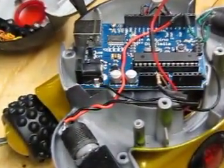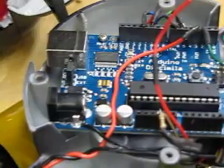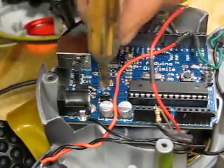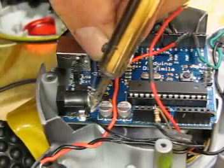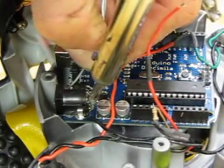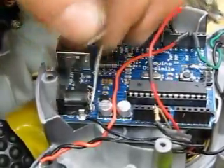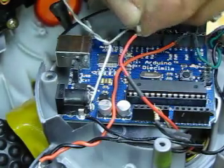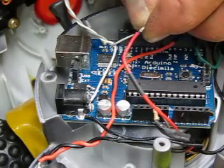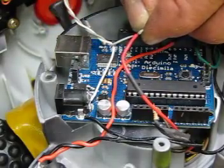I'm ready to solder up my switch wires, and I'm going to solder them right onto this power jack right here. First, I'm going to connect the white wire to the back of the switch. I'm going to get a little more solder down here on the board just to make it a bit easier. It doesn't matter which one goes where — it's just a switch, you can wire it any way you want. I've got a piece of heat shrink waiting there to cover this joint up. Now I have a nice little solder splice for my power: power comes in here, goes to the switch, runs back into the white wire, and feeds the Arduino power when I turn it on.